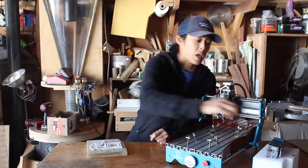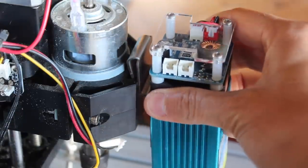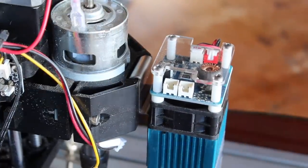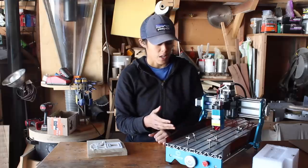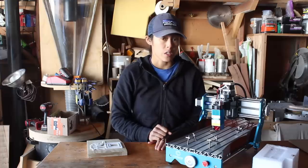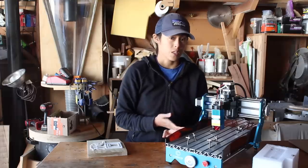I will note that this machine can be ordered with a laser attachment. I'm not a huge fan of how it attaches to the machine — maybe you could make some parts to make that a stiffer and more repeatable attachment. It's important to note that this machine does not come with fume extraction or air assist, both of which are really important for cut quality as well as safety. Without fume extraction, that really limits the kinds of materials I would be willing to cut on a laser.